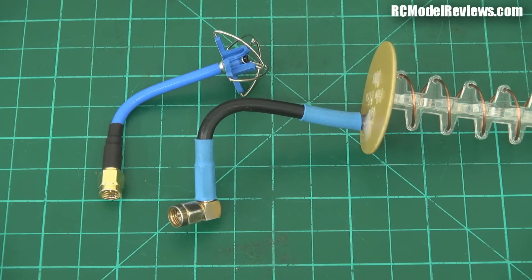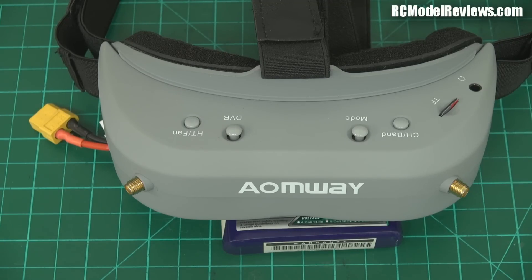Let's go through the pros and cons. Pros: they're a pretty damn good price - much cheaper than Fat Sharks, especially when you consider you don't need to go buy a LaForge diversity unit to get true diversity. They have really good, sensitive receivers that work well. There's a good amount of information on the LCD - frequency, which antenna has been switched to, whether you're recording. The picture quality is pretty good, aside from a little blurriness in the corners caused by the somewhat stretched optics.